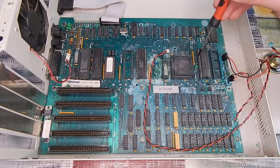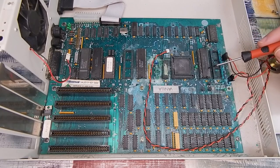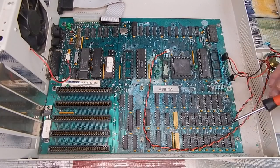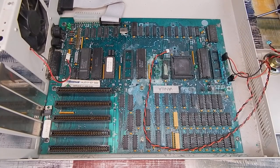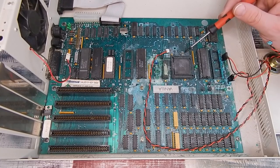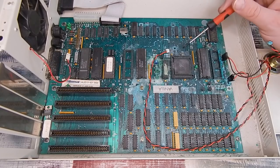There are a couple of NEC branded chips in here. And speak of the devil - there it is. NEC V20. So yes, that is our processor. No doubt that used to be the processor's crystal, but you can't even make out anything on that now - that's how bad the corrosion is. I need to get this motherboard out of the case.